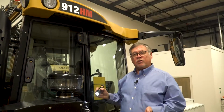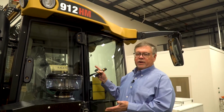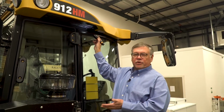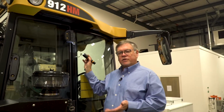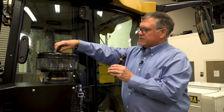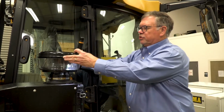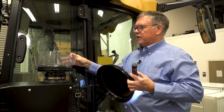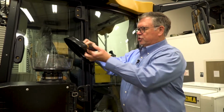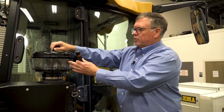We're now going to check all of the air filters on the truck. They're all mounted on this side of the cab. The cabin air filter is mounted underneath the roof. You only need to take that off and check it once per week. The engine air filter has a pre-filtered dust bowl at the beginning. To access the dust bowl, you unscrew this wing nut on the top, lift off the dust bowl, dump the coarse dirt out. Be sure to re-secure the housing with the wing nut.